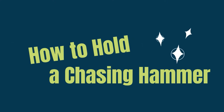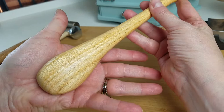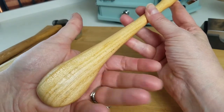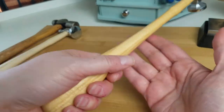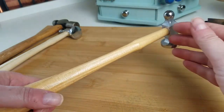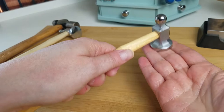We've already talked a bit about grip — let me go over that again. You want to position that bulb right in the palm of your hand and wrap your fingers around it. That's the correct position for planishing. Something I see a lot of beginners do is grip their hammer up closer to the head, thinking they'll have more control if they're closer to the head.